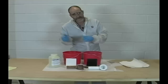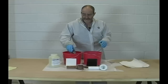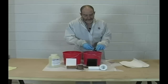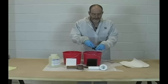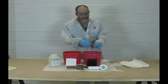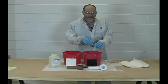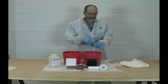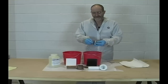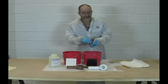It's not like we're using 50 gallons of this flooding down your pipes damaging and destroying the world as they would have you believe. Here's our chrome drain in great shape. All drains nowadays come chrome, and if you get the fancy drains with satin brass finish or nickel finishes, it's a very thin coating over chrome that's electrostatically applied — the acid will eat those finishes off. So if you've got satin-type finish drains, they need to be removed during the process if you're going to have it etched, or they need to be protected.